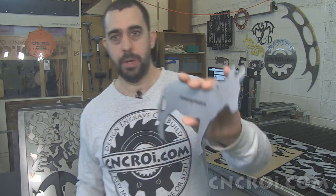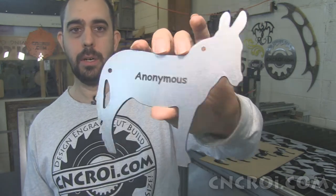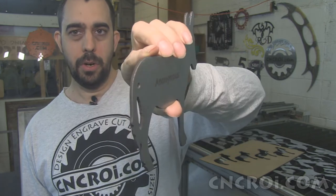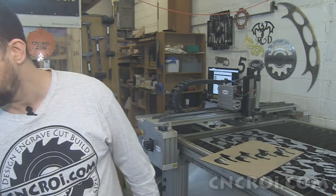So after that, I'd put an industrial finish over it so that the etching has a higher visible angle at all angles. If I don't do that, you go maybe like this, you won't see it as well. But this sort of gets rid of some of the shine, but also accentuates the contrast created by the fiber laser. The reason why I use the fiber laser instead of bonding paste or any other process to do this is that this is permanent. I've had a ton of misery with bonding paste and that kind of stuff, and I don't need to deal with it whatsoever.